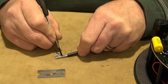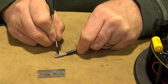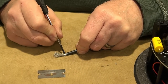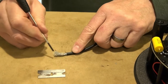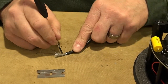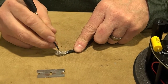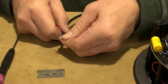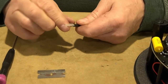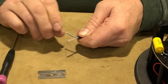This is a 50-ohm impedance cable, but that's measured in the megahertz and gigahertz range. When they say it's a 50-ohm impedance it has really no relevance in the audio range of frequencies. It's really not a 50-ohm cable when audio is involved because the audio is such a low frequency.